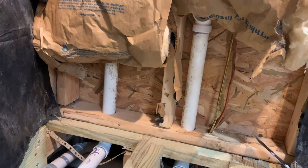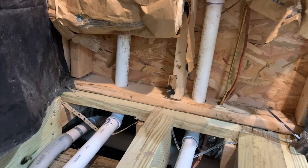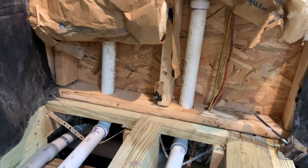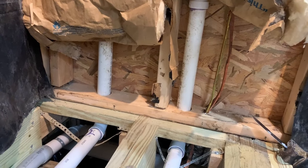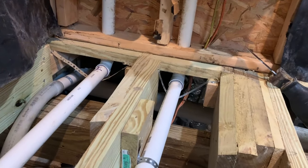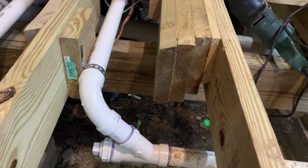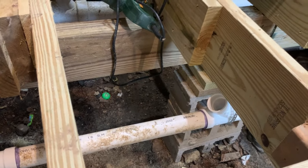The primary sewer and water piping has already been put in place. That is the beginning of a special type of air admittance valve — an AAV vent, I believe they refer to it as. Since this wall goes into the ceiling I couldn't put the vent pipe up through, so with an AAV vent you can get away with not putting one in. You run it a specific way in the opposite direction, and it allows you to vent with no problem. Down through there is the entrance for the shower.